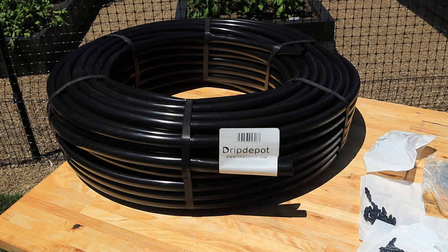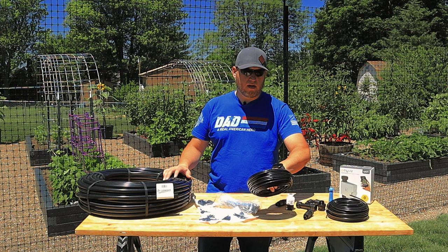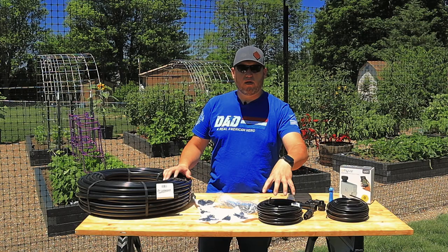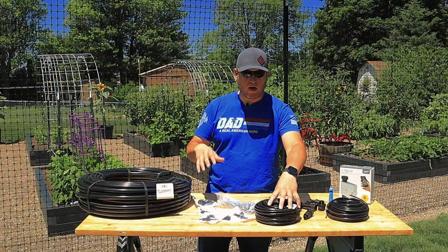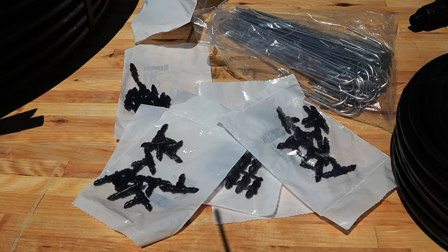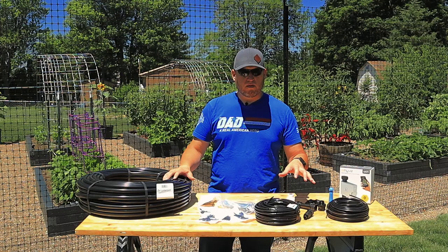So there's going to be other stuff I have to buy, but this is what we have. I upgraded and got 200 feet of half-inch main line, 100 feet of quarter-inch, and then another 100 feet of what's actually called dripper line. This has holes in it every six inches. What we'll do is put this around the base of the tree, around the size of the root ball, so when it's running it soaks the entire area. Then you have stakes for the lines and a bunch of different fittings — T fittings, unions, connections, 90-degree fittings for the half-inch line, union couplers.